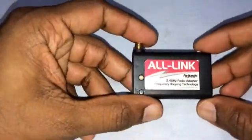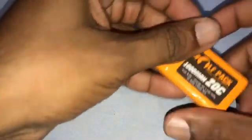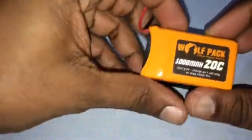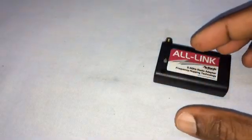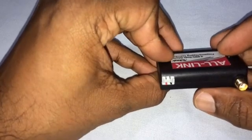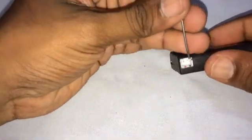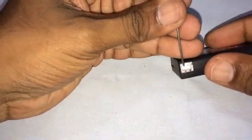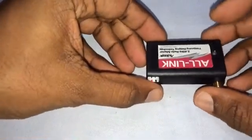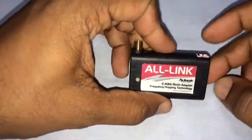For this module to work with the TH9X it needs an external power source. I am using a 1-amp single-cell lipo. This connector also has a polarity — I have marked black and red here. This is the negative and this is the positive. If this is connected in the reverse order your module will stop working and it will burn off some of the components, so please make sure that the polarity is right.